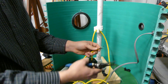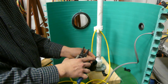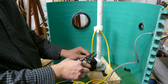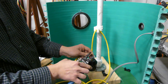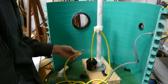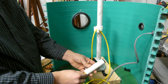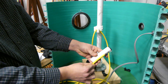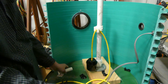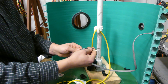We've got those ends trimmed. One important thing: you want one wire about a half inch longer than the other. We'll trim one back and restrip it — I'll explain why in just a second. Now if we insert this all the way to the bottom, a large portion of the jacket is going to be encapsulated in that resin. Now we'll get the UF cable ready the same way.